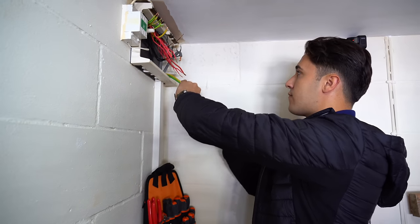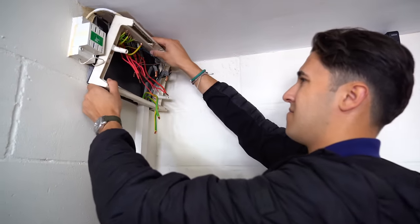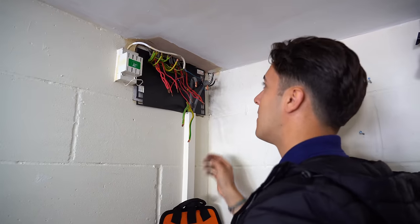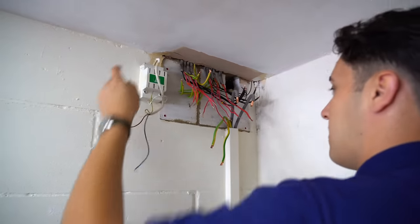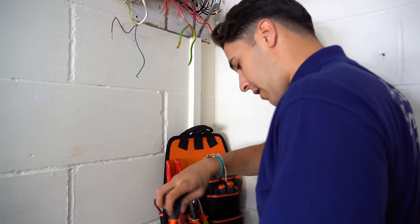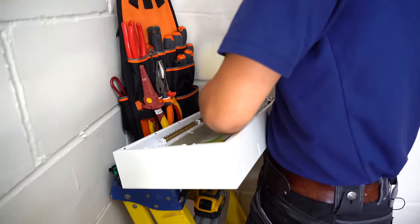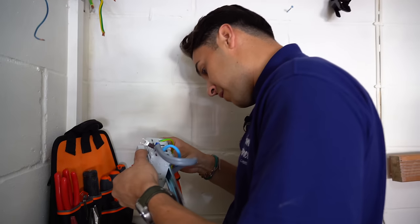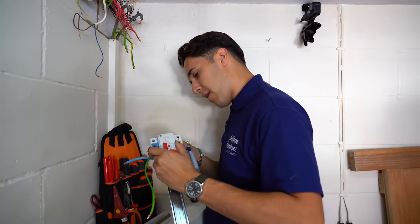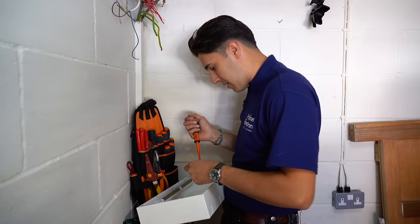We might swap the tails — we'll see where they fall on the new kit. Not loads of length but we can make it work. If we get the consumer unit up here, I'm tempted to batten it off. I'm going to take all the innards out so I don't damage it. Something you've really got to bear in mind at the minute with people working from home — I've very nearly turned the power off for people before, tripped the wrong circuits, and people have UPS systems that don't appreciate being switched off in a hurry.